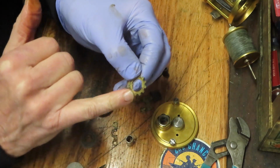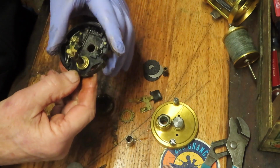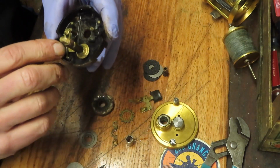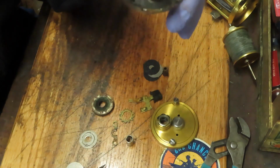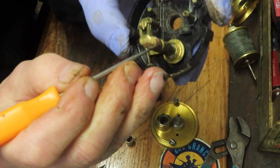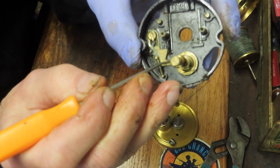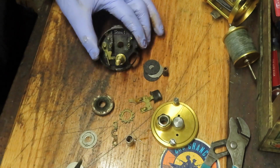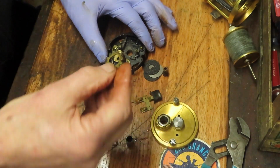This is kind of a notched click ratchet that's going to throw the trip lever back. And this trip lever, this one's in good condition, but this trip lever has a round circle here that's going to fit in those notches. And a lot of times with extreme use, this rounds over or rounds out, or it becomes very worn and doesn't have enough to catch this piece.